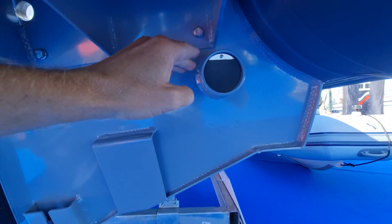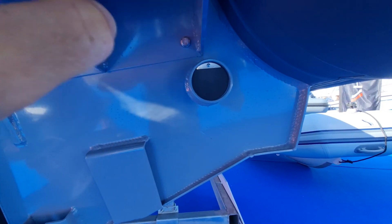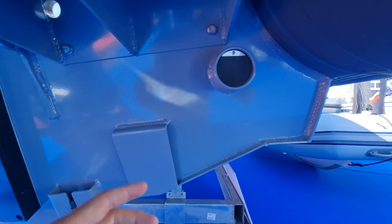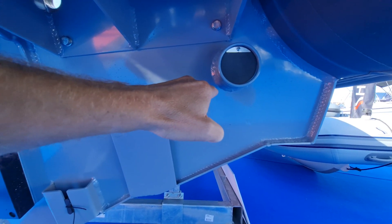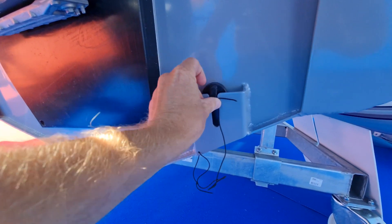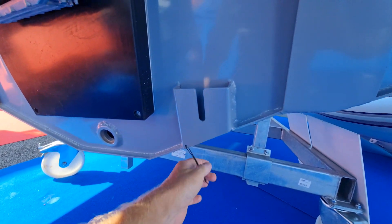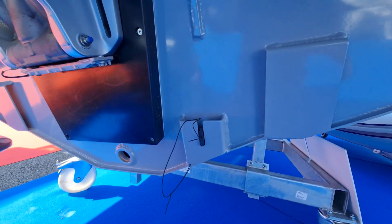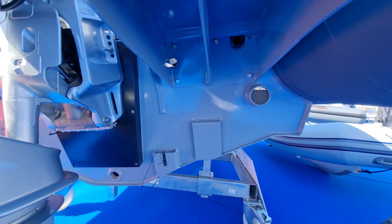Some boats will tell you they're self-draining but the waterline will be higher — meaning they will only self-drain when you're moving forwards. That's critical for any of you that have the boat on a mooring, on a swinging mooring, when the rain is coming. It's really important to have a self-draining boat and you need the waterline in the right place. Here we also have a little storage pocket for our drain bung, so when you're trailing the boat you're not going to lose it. From a hull design point of view, there is an awful lot more to it than just reading a deadrise angle on a forum.